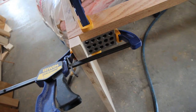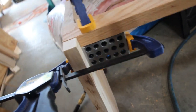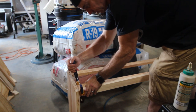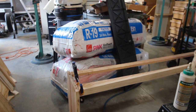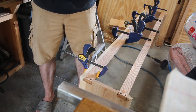I squared them up with 1-2-3 blocks and used oak for the stringers. The oak gets hidden — I just used it because it was scrap and it's strong. I put a piece of hickory on the front to cover the oak so you never see it. The oak is glued and screwed into those channels I cut out.